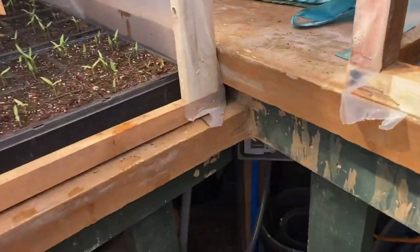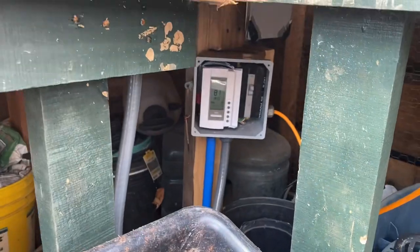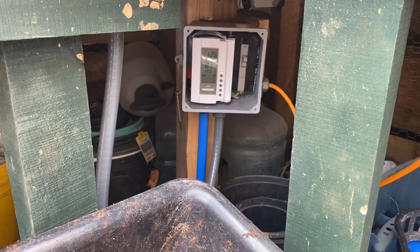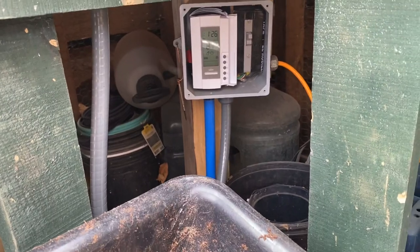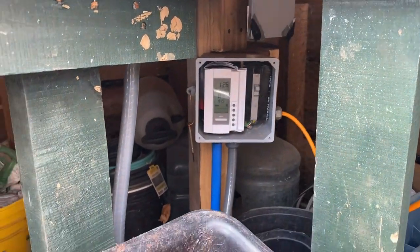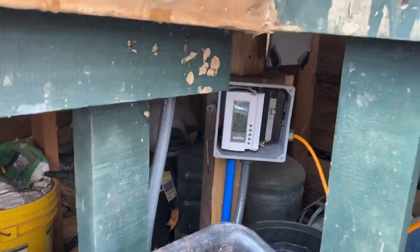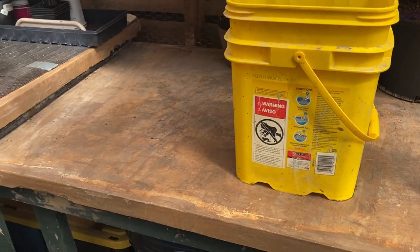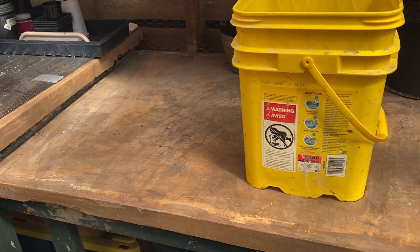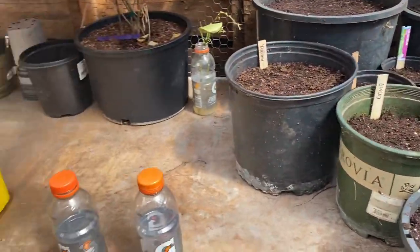There are some pros and cons. The proper underfloor setup has a nice thermostat — it's really controllable — but the drawback is it's a little more complicated with wiring, so I made it waterproof with a cover on the box. The roof cables are plug-and-play: if you can run an extension cord, you're good to go. They don't have a thermostat so you have to turn them on and off manually, but it's much easier.